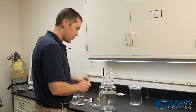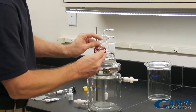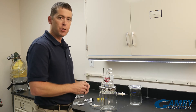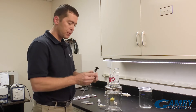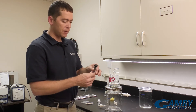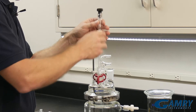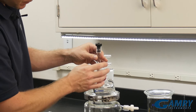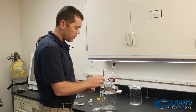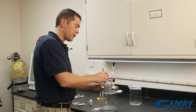Next, we can take our ball joint adapter and place that there, and we take our clip and add that there. So this can move a little bit for adjustment of your bridge tube and reference electrode. Next, we would have our bridge tube, which already has the O-ring and screw adapter on it, and it also has the top adapter. This is where your reference electrode will actually go. We place this into our cell and screw this down. If you have an open port, you can take one of these plugs and just screw that into one of the ports.